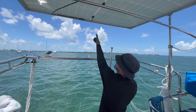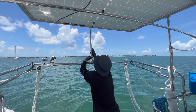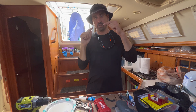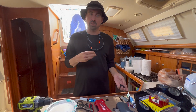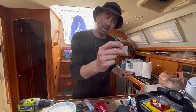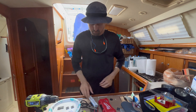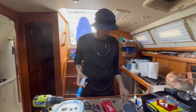This hardware is a black pole holder that's going to support the back of our panels. We're working with aluminum metal and the screws are stainless steel — I'd like to avoid mixing different metals because of the galvanic action that can happen when salt water or even fresh water hits them. So what we're going to do is use epoxy. I've removed the adhesive backing, scuffed the surfaces with sandpaper, and prepped the bracket too. I just need to mix the two-part epoxy and put it on the back and press it in. Honestly, I don't know — maybe a bolt would be better. We'll see how it holds.